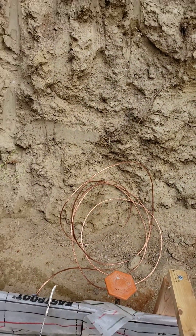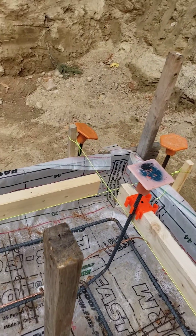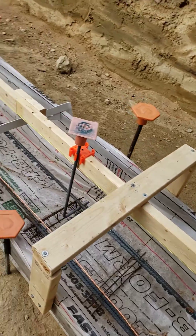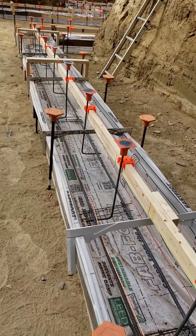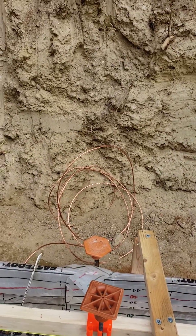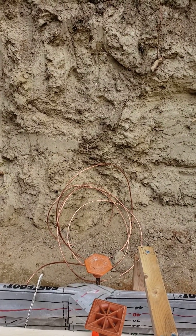The coil will run up to the panel and ground our electrical system. But for us here, the code is a minimum of three connections at a linear footage of 20 feet. I'm told we have about 24 feet here. We have our three connections, and we have our piece here that's going to go up into the panel. So, we are good and soon to be grounded.